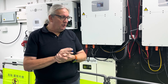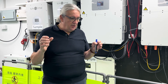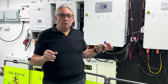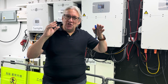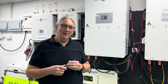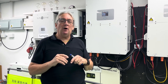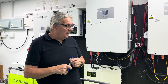Before you switch your AC on, check your maximum battery charge setting. At high voltages, the currents are much lower — so where at low voltage you might charge at 50 amps, here you might charge at 10 amps at 600 volts, which is 6 kilowatts of charging power pulled from the AC. Start the charge current quite low so you don't suddenly trip your breakers when AC is first switched on — it's much better to start low and increase gradually.